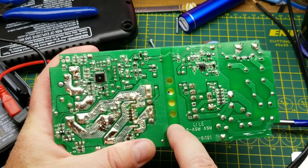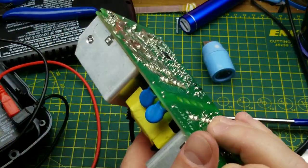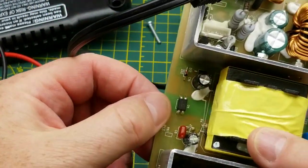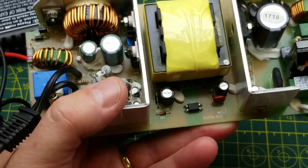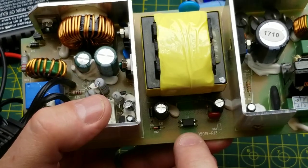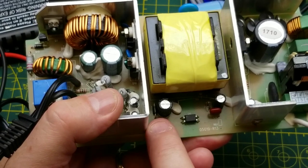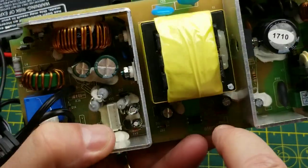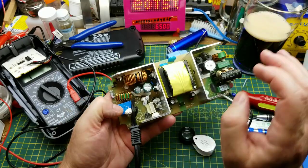Note the isolation — big wide gap on the board. The only things bridging the gap are two Class Y2 capacitors in series with a small island between them, and a little four-pin DIP device — an opto-isolator, of course. On the LED side of the opto-isolator there's a zener diode, a regular rectifier diode, and a capacitor, plus a couple more capacitors and resistors on that side. Classic switch-mode power supply stuff — that's the high-voltage side with full isolation.